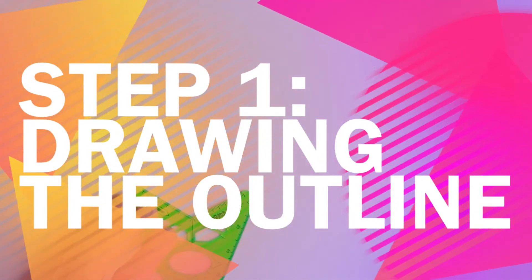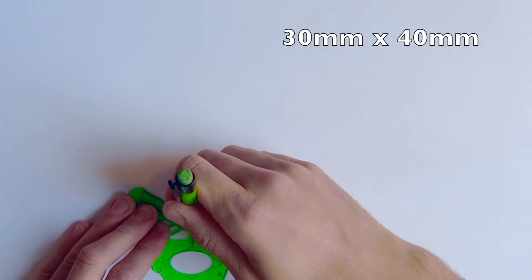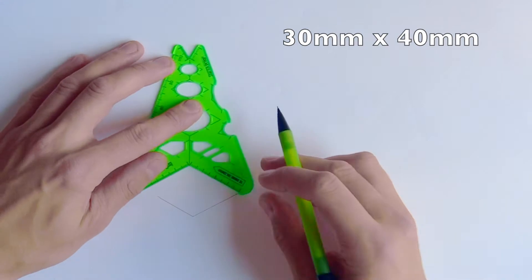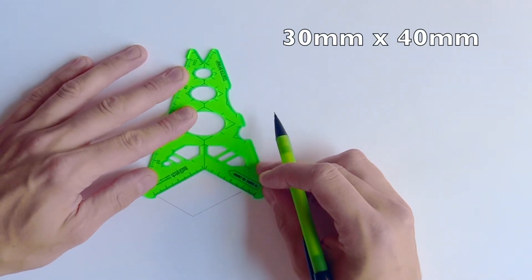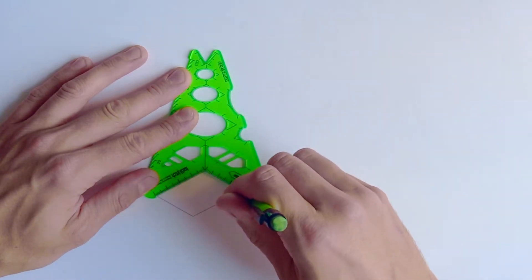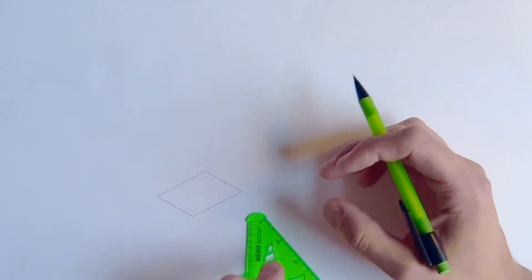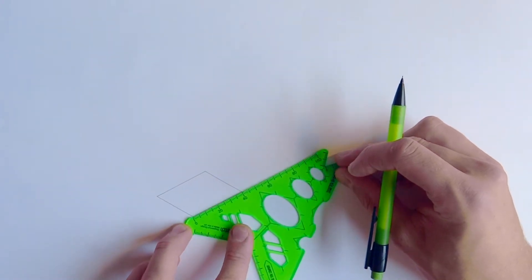The first step is to draw the outline of the no-go zone with the ISO sketch. The best way to do this is to follow the dimensions on screen and watch what the tool is drawing. We're using the V of the ISO sketch to start with a 30mm line and a 40mm line which make a V shape, then joining them together in reverse to create an oblong in the isometric view.